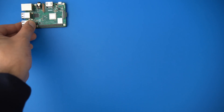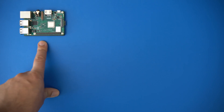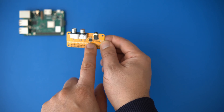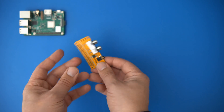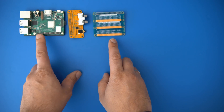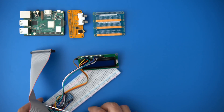Let's look at the other things you need for this project. First and foremost, a Raspberry Pi — this here is model 3, but model 4 and the new Raspberry Pi 400 should work as well. If you want a linear noise-free audio output, you'll also need an audio hat. This project requires a PCM5122-compatible digital audio converter, and luckily this cheap audio hat from raspberrypi-audio.com checks that box. I'm using a port extender so I can also connect the other components, giving three GPIO outputs instead of only one.